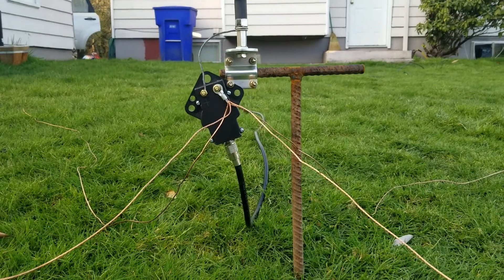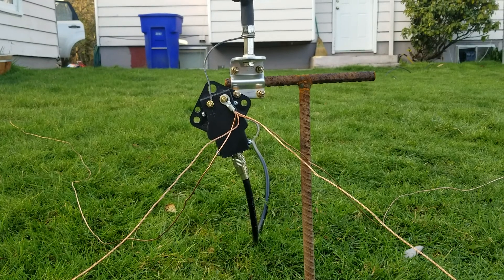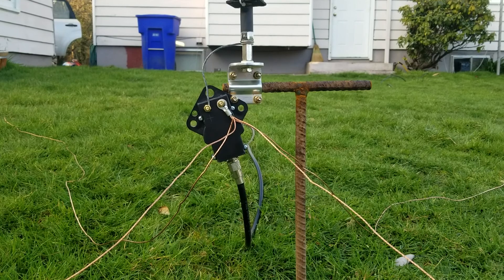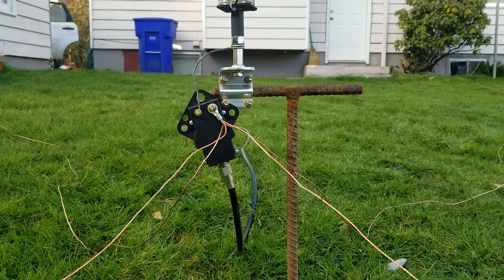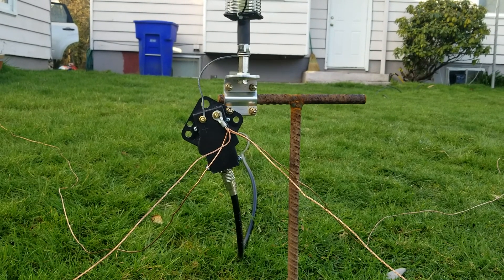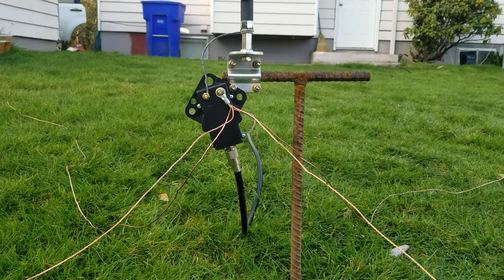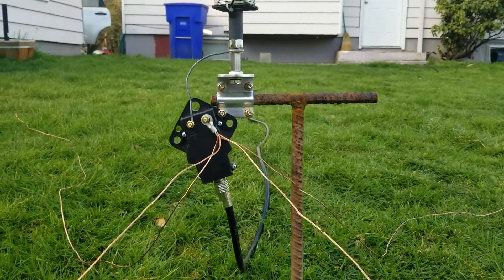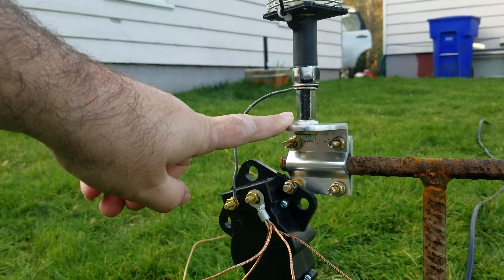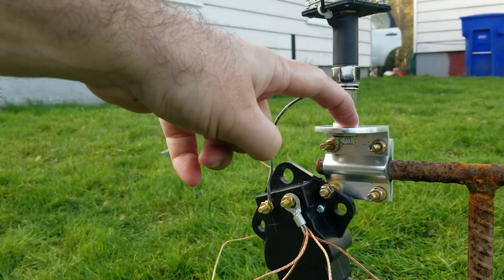I had to set this whole setup completely different. That is a balun — it's just a real simple one, there's no core or anything in there. It's just the coax connector on the inside with wire that goes up to either side. You tap hot and you tap ground. I had to use that because these mirror mount brackets — used very much in the trucking industry, little plastic deals right here — just can't handle the power.